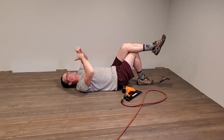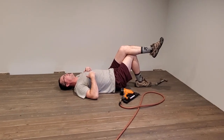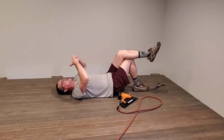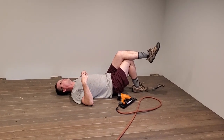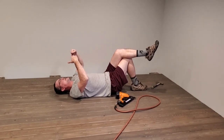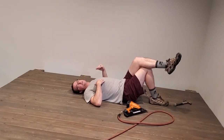It's got this little crack left. So it just plops down in it. You can leave a little bit of it, like you can cut half of it off so it just has a little bit. But the problem is if it's full tongue, you can't set the board down and then slide it in because there's no room against the wall.